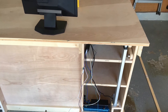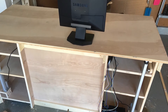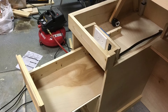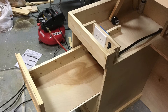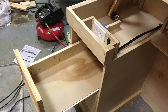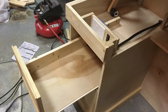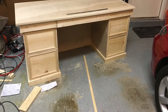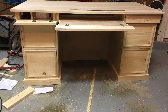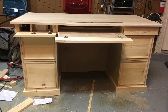I began the wiring using the equipment that we ordered from Amazon that came along with the linear actuators. It's pretty simple — just follow the directions. There's a control module that hooks up to everything, and you can see the black switch there that controls the up and down motion. We added a secret compartment so that trim piece actually folds down with a spring-loaded hinge, as well as two electrical outlets if we need to plug anything in. From the front, you see it looks like a normal desk. In the middle is a keyboard tray that actually slides out.